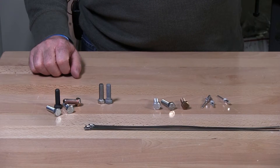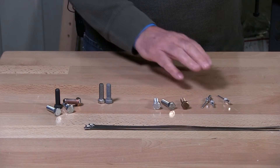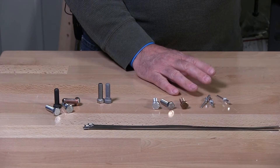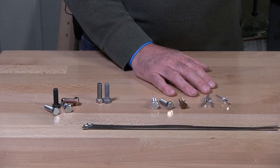When you're dealing with rivets, 316 stainless steel rivets are not available, so you will have to use an aluminum rivet if you don't want to see rust. 18-8, 303, or 304 stainless rivets will rust over time.